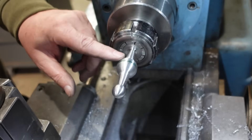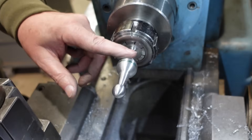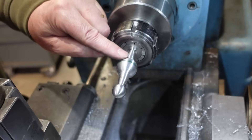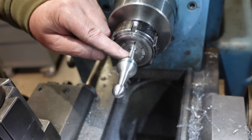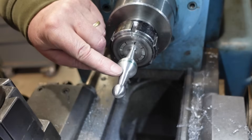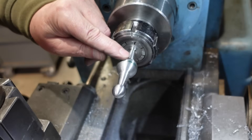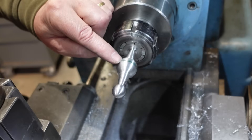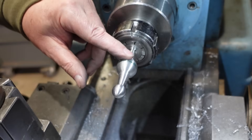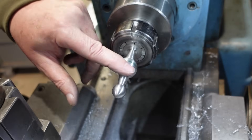As you saw, I had to switch to the file — I was just starting to touch over here. It gives me a slightly rougher finish but I'll polish that out. The texture is to show me where the line is. When I stopped with the ball turning device I still had a bit of a flat, so I wanted something that would indicate as I rolled over the shape with the file where the centre line was. I'm now down to a point where I've just got the colour showing — that's as close to spherical as I think I'm going to get. I might go to a finer file then finish with emery.